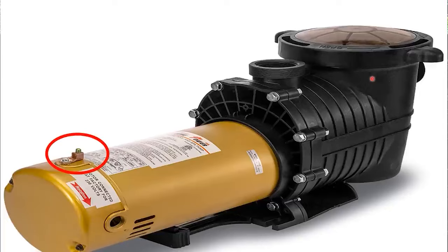Scenario two: the steel rebar does extend three or more feet, but there's a conductive pool shell that is not physically attached to the steel in the same way as a gunite pool. In this case you'll have to do your four bonding points. You'd bond the heater, the pump, and then at your four points also bond to the steel. The code states that the steel ties used to tie the rebar together are equivalent for bonding on that portion. Then you'd jump off the copper portion of the grid or some part of the metal — depending on your inspector — and bond the diving board and the metal fence. Work side by side with your electrical inspector throughout the entire install; they want to help you and see you succeed.